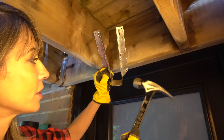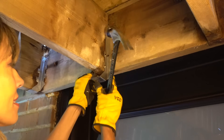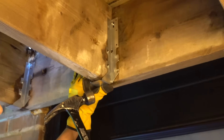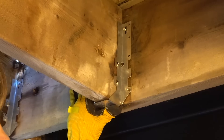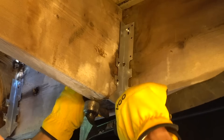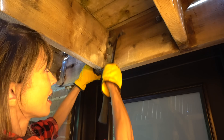What you need to know when hanging your joist: there's a prong at the top — keep your eye on that. You're going to need a hammer. Slide it under your joist. The biggest mistake is joist hangers cannot sit with any gap — there can be absolutely no gap here; it has got to be as tight as you can get it. Hammer underneath to get it tight. Hold with one hand, grab your hammer, whack it, then squeeze it quickly. Hit the prong — see that? Nice and tight.